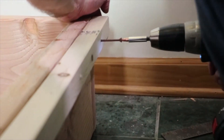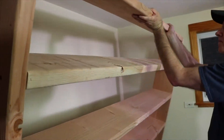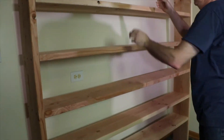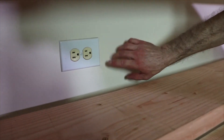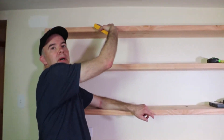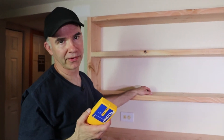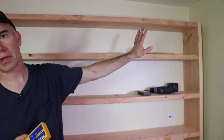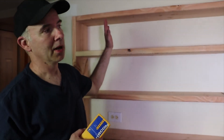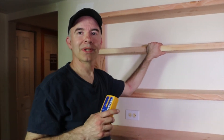This 2x2 will be used to secure the shelf to the wall. With assembly complete, we lift the shelf into place. Be sure to measure the shelf spacing correctly to avoid putting a shelf across any wall outlets. With the shelf in place, we want to make sure it's not going to fall, so we're going to find the studs and drill through the top — about six or seven screws — so this thing is securely fastened to the wall. I'm using a stud finder, because normally studs are 16 inches from the end of the wall, but using a stud finder makes sure you're actually screwing into solid wood.